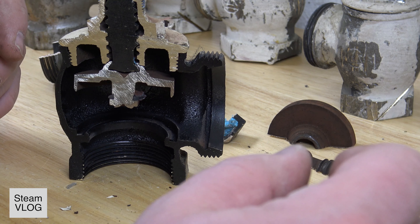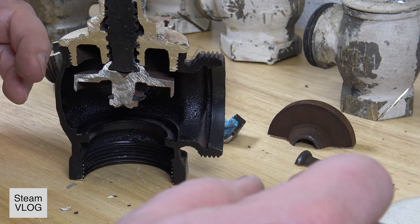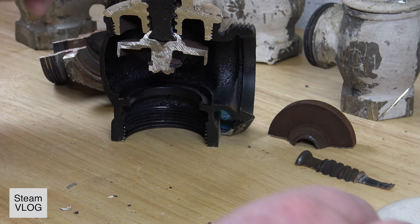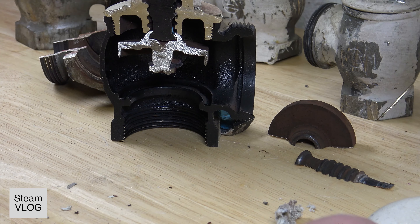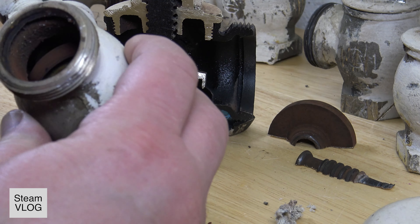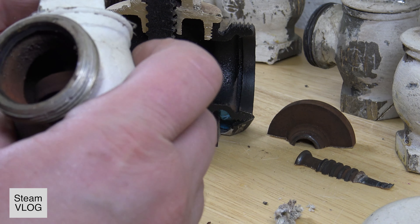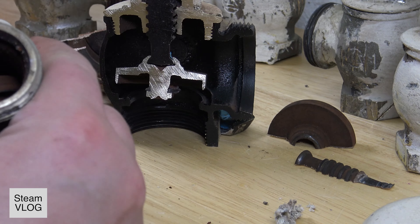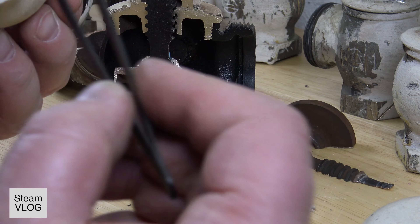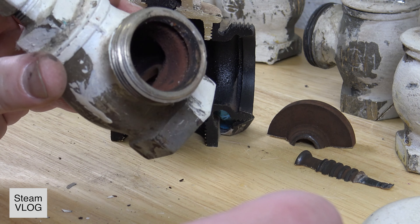You cannot close the valve anymore after this repair — that can happen. But why would you have to close the valve? You have to close it if you want zero heat in that room, or if the radiator cracked and broke — then you'd need a functioning valve you can really turn off. But so far, take this valve for example: it is very hard to turn because the packing is still intact, it's open all the way, steam can go in and out — so this one would not have to be replaced necessarily, it would not be urgent.